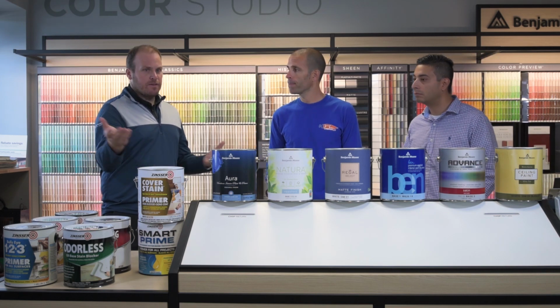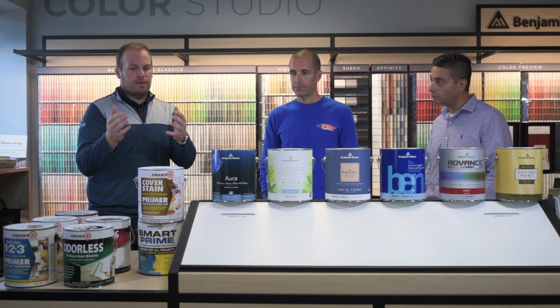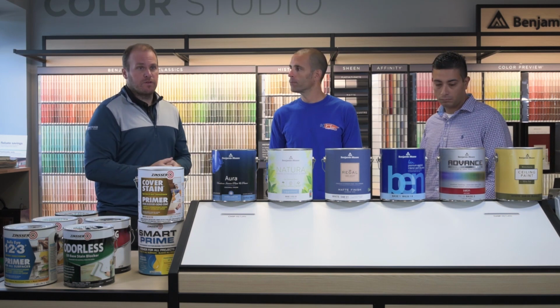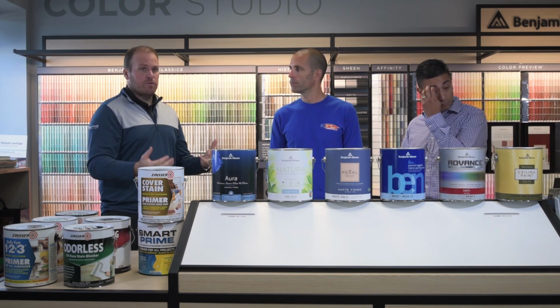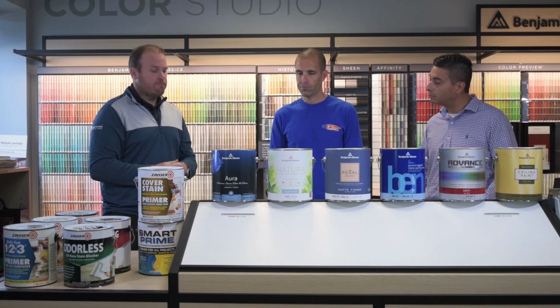So the only downside of this is that it's oil based. There are going to be some areas in the country where you can't even get this product because of the VOCs. It is also mineral spirits cleanup, so you do have to have some mineral spirits to clean up your brushes or any spills or your hands and things like that. Yep. Okay, great.